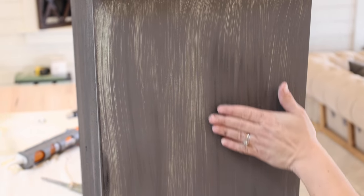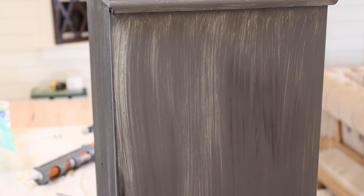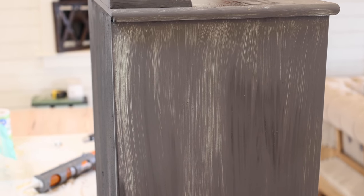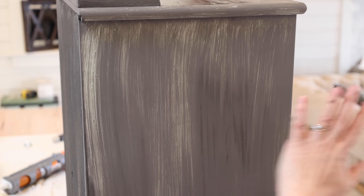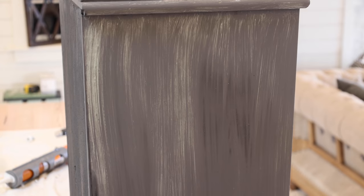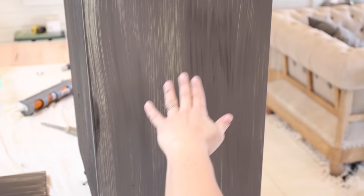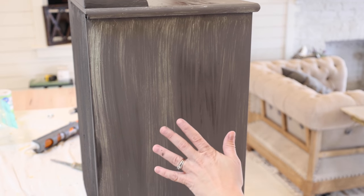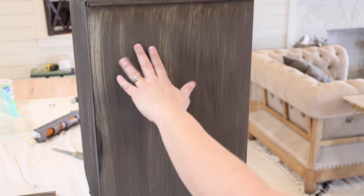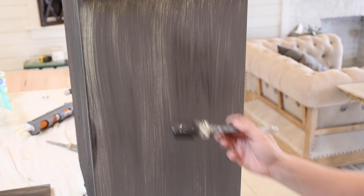You can see areas where the paint was thicker and coverage was almost 100%, but on areas still a little shiny from the spray paint it's streaky — completely normal. On porous wood without a finish, weathered wood is almost always gonna give you one-coat coverage. Make sure you have a generous amount of paint on your brush and your wrist is not super tight — you gotta be loose. Once you get the paint on there, don't push down super hard or overwork it. This paint has water in it — it's water soluble — and if you work really hard you pull off that first coat, which is really frustrating.